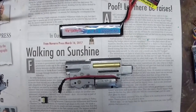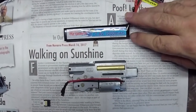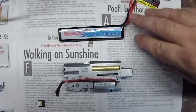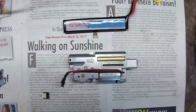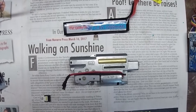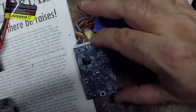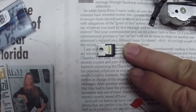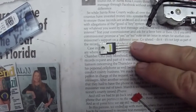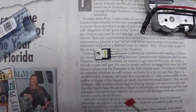A quick overview of the electronics we're building: we're using a 7.4V, 1,000mAh LiPoly battery to drive it. That's great for this low-power electric gearbox, but it's too much juice to feed back into the plasma pistol's original laser tag electronics, which were designed to take 6 volts or less. So we're using a voltage regulator that takes anything up to 12 volts and knocks it down to a clean 5-volt power supply to run all our legacy electronics.